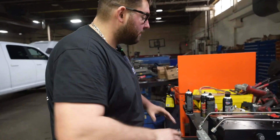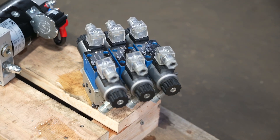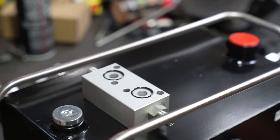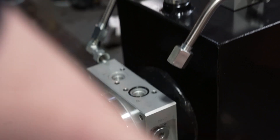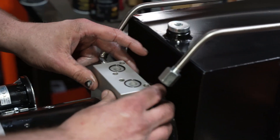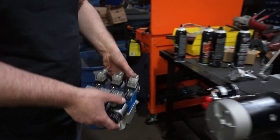And that's it — motor's back on, seals are good, two o-rings in there to pay attention to. We already took it all apart, we got all the pieces, and now we are going to put the valve stack back together. Our valve stack is right here — one, two, three, four sections to it. This is the first section you're going to put on. We need o-rings in the top of these right here — one drops in nice, just like that. Grab the other one; make sure there's a little bit of lubrication on them when you're putting them in — makes them seal a little better.